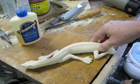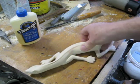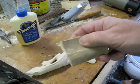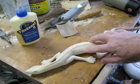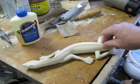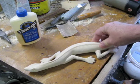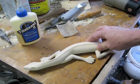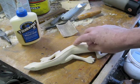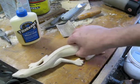Now the thing with the sanding here is, sanding is putting scratches in the wood. That's basically what you're doing. You have little tiny pieces of crushed abrasive material on here, and it's putting a million little scratches in the wood, and then as you progress, you make the scratches smaller and smaller until they aren't very visible. But they're there, and the difference between that and the surface that comes from a sharp scraper or a sharp knife is completely different. So you have to be accepting of what that's going to look like when it's finished.